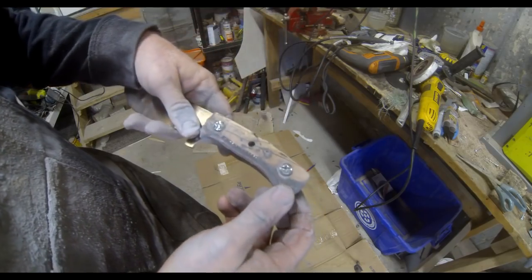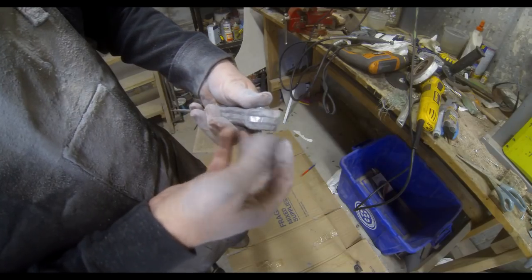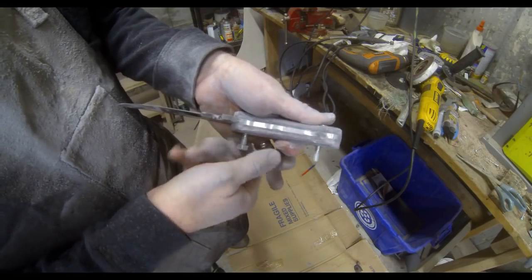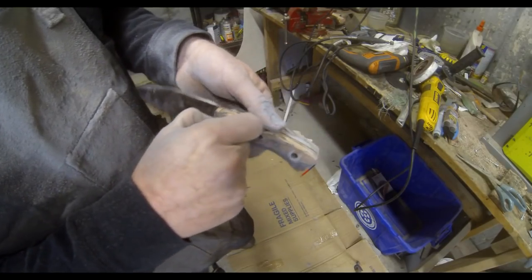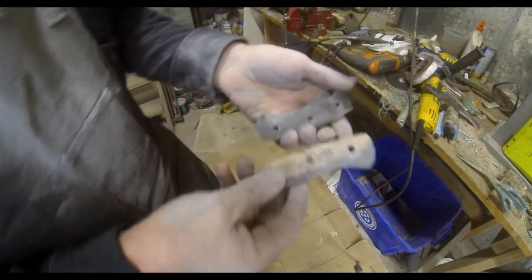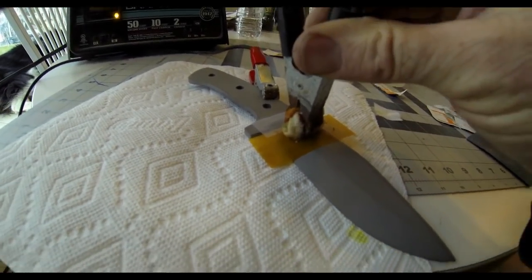That's not exactly the way it turned out. I basically finished forming these scales using a Dremel grinder, a belt sander, and a little bit of hand sanding. They're going to mount to the blade just like any other scales do. For this particular one, I'm going to use three quarter inch brass pins and glue it all up with a two-part epoxy. These are the hybrid scales basically roughed to shape — they do just have to be polished. This is kind of one of the places that I went wrong.